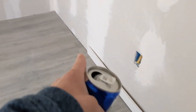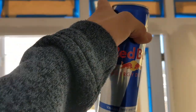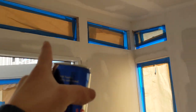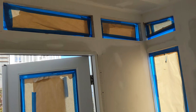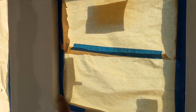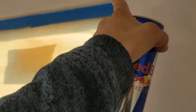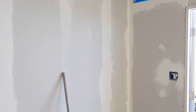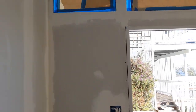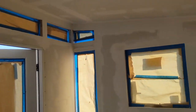And now we're going to start running baseboard and our door trim around your windows. It's going to be flat finish all the way around to your windows — just going to be a nice 90-degree angle around all your windows. Level three to four flat tape rock is what is in the studio shed install. And then if you want texturing or something different, then that's extra that you can talk about with your installer.